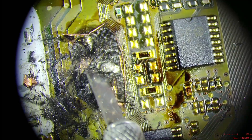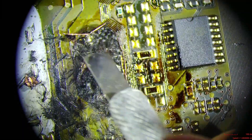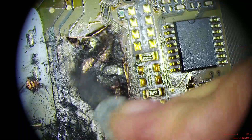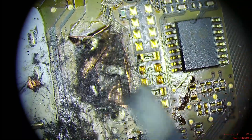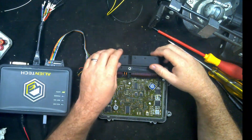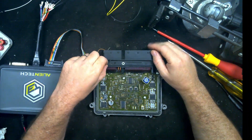This internal layer is kind of damaged too. I don't know what it is — it's probably another ground, probably attached to this. You see how the through hole comes and connects with it. This is just kind of a fool's errand. There are traces coming through here, and these aren't connected — these are all different things. At this point, I think I'm just going to clone this one and transfer it over. It's unfortunate that something so simple can cause so much damage like that. I have already read the original — I had to turn my big exhaust fan on because the smell was just too bad, so I didn't get that on camera.